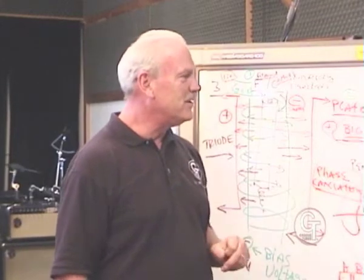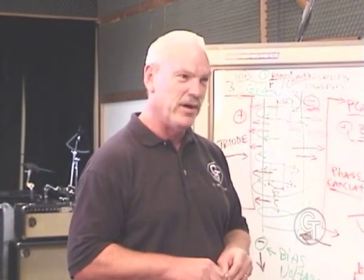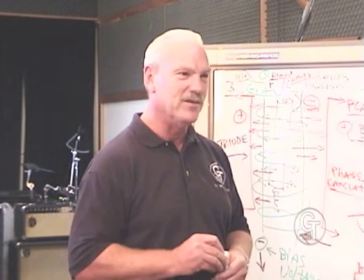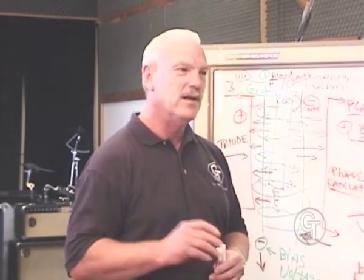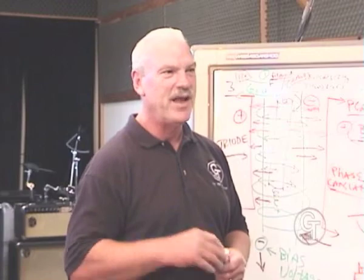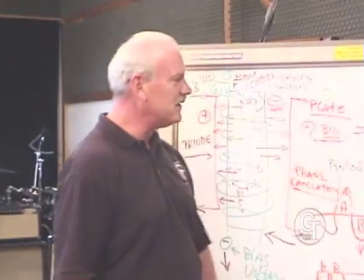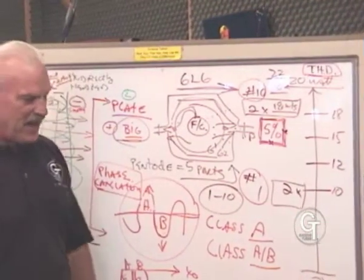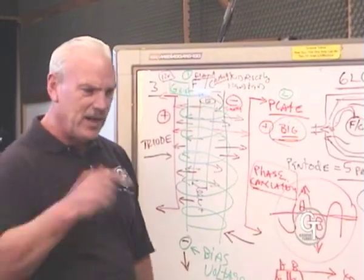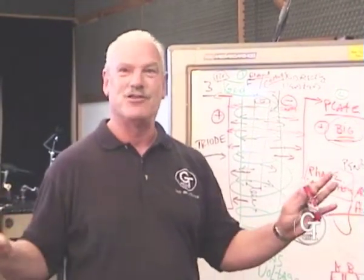I spent pretty much a day measuring some 6L6 GEs from the local distributor, then took them to the Doobie Brothers' rehearsal and recording studio. I did the 310 Bandmaster for Pat Simmons between breaks. They had been recording him, so it was interesting to hear the amp before and after the tube change. I changed the phase inverter, put in a selected preamp tube, and installed a matched pair of 6L6s from this system — something in the middle, maybe a number 5. The engineer came running out of the studio asking, 'What did you do to that amplifier?'